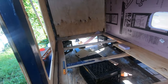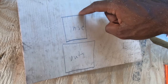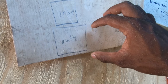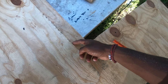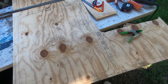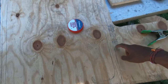The exterior part of the door is all sanded up and fits really well in that hole. What I'm going to do is get the outer piece done. It's a crude drawing but: the inside is a certain diameter — say one by two — then the outside is going to be like one and a half by two and a half, so there's a little bit of overlap. That overlap is where the weatherstrip is going to sit so the door is nice and watertight. So I'll take the board I just cut, trace it out, measure about an inch off the edge all the way around, and cut that out.